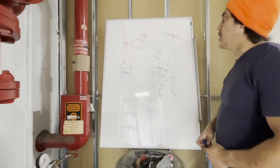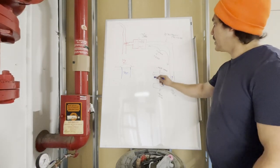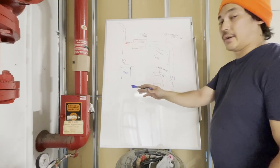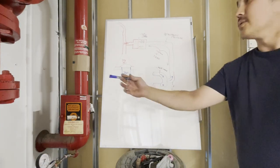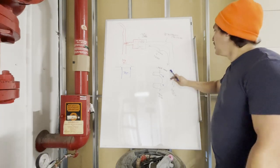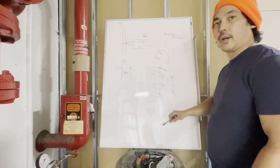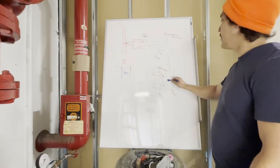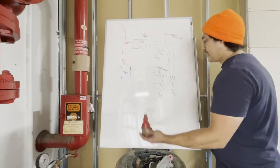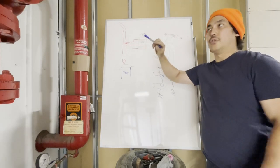Back inside now — I'm going to show what's happening with this fire department connection. We were outside and I showed you how there are two check valves there. The pump head is actually buried in the wall — it's a big brass chunk. We have a spare one, which is great. There are two two-and-a-half inch snoots — custom cut pieces of two-and-a-half inch pipe — they tie together, come up, there's a ball drip down here which I've disconnected, the pipe comes up and over, goes into a check valve, and into the system piping.